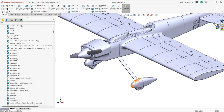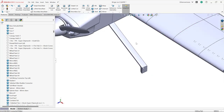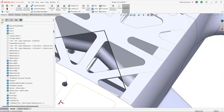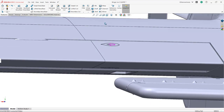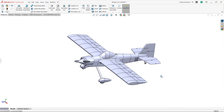I also made some structural improvements to this design versus some of my previous designs. My main structural concern was with the rigidity and durability of 3D printed landing gear, especially with the largest version of this design. So I designed the landing gear struts to house a carbon fiber tube that runs the length of the strut, into the side of the fuselage, and fuses with the rigid plastic tray that runs through the center of the fuselage. I also had a concern about the strength of 3D printed control horns. Rather than having the control horns print in place, I left a hole through each control surface and will be using a bolt held in place with a lock nut to act as the control horn.